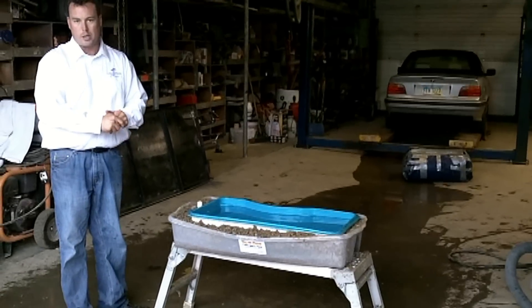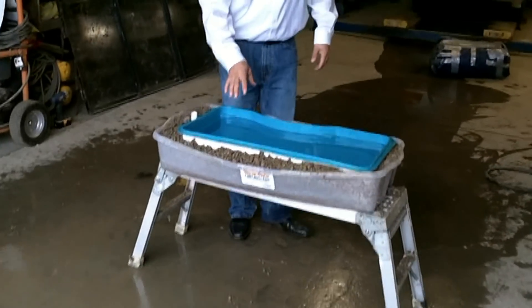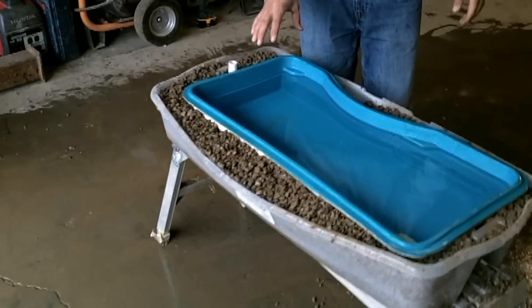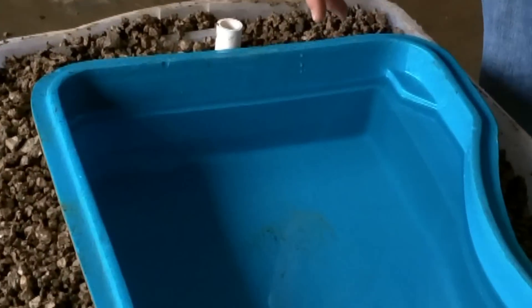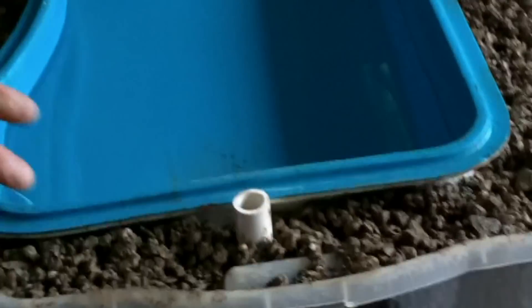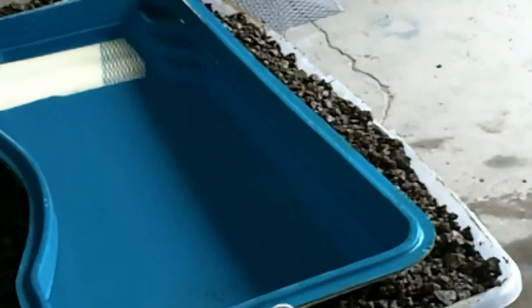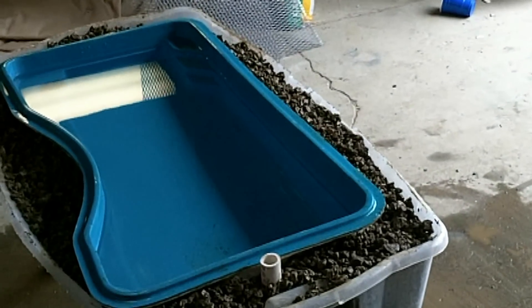This is physics 101 and buoyancy. We've got our pool set on a bed, backfilled, and it's got water in it. We're just above the convenience ledge, and we're going to fill up the hole all the way around. This little pipe represents our sump tube, which is used to see what groundwater looks like and pump it out if one ever needed to. It's just insurance, but we've tried to keep this as accurate and scaled as possible.